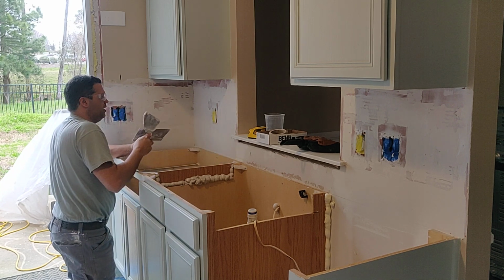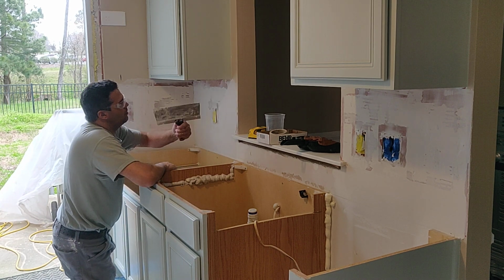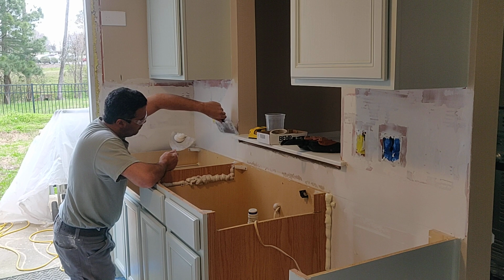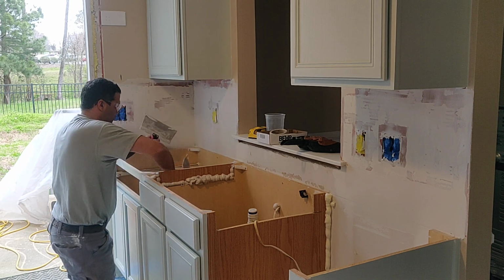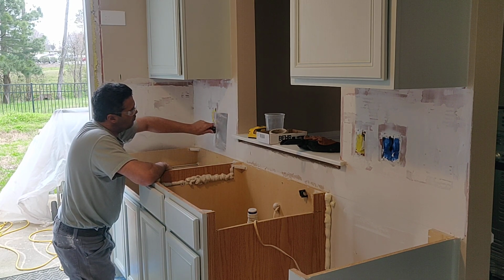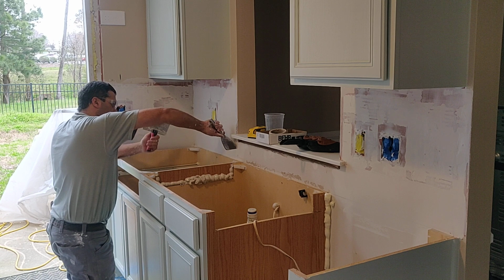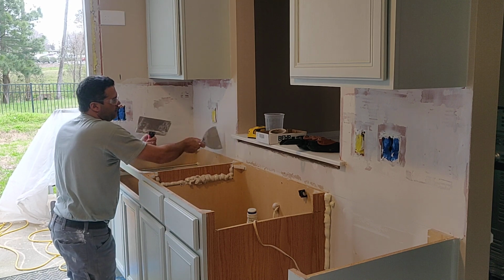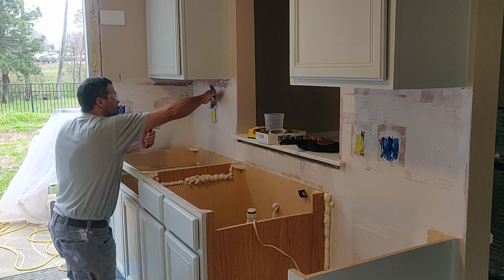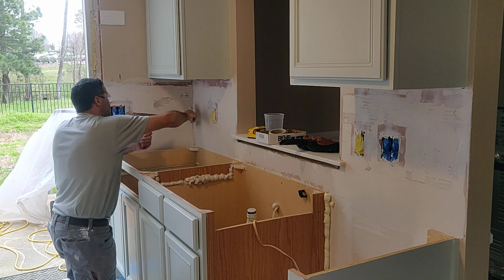Problem is just this corner bead. Oh God, I'm making such a mess here. Yes, just like that. When they put that corner bead in, it takes the wall out of square. It's got to, right? It's got to build up on each side. The corner bead ends up taking the wall square before that, and it's not square after. A lot of assemblies involving corners end up fighting with it, cutting the trim around them corners, if it's a finished drywall wall.